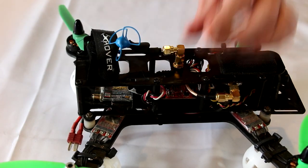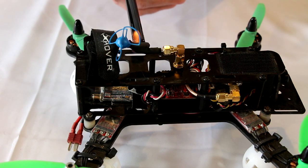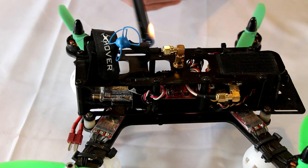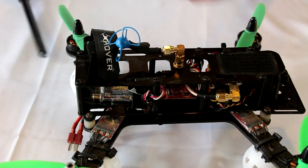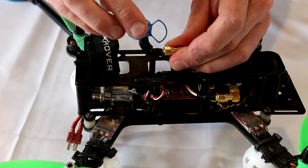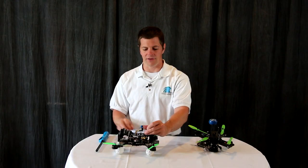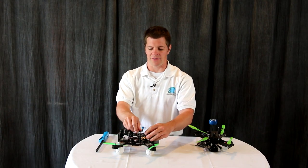Also, the straight stock is much shorter. You might ask yourself, isn't the antenna laying flat? Well yes, but most antennas are designed to be bent to shape. The way you do that with this race spec is simply heat it up with a lighter and then fold it up to the proper orientation, let it cool, and it will retain that orientation.